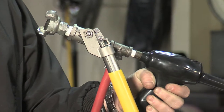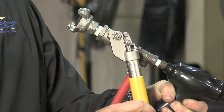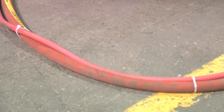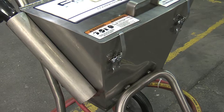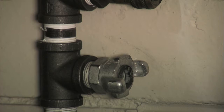Check the ball valve at the end of the blast gun to make sure it's in the closed position. This valve is spring-loaded. Be sure that there are no kinks in the blasting hose and that there is no damage to the hose or dry ice blasting machine. If any kind of damage is noted, it must be repaired before the Freeze Clean Machine can be used. Please note that if an airline has not been used much, water and rust may have collected in the line.